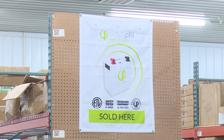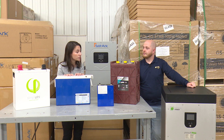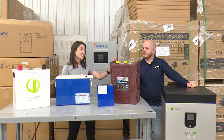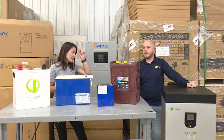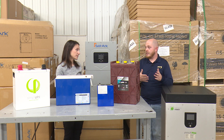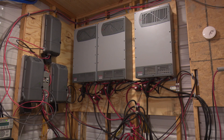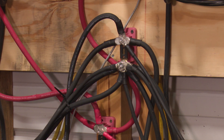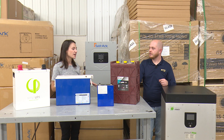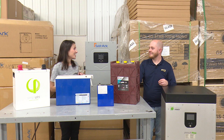If you have the money, the real investment is in lithium technology. At entry level, a lead-acid battery runs several hundred dollars; a sealed AGM runs several thousand; and a lithium battery is ten thousand plus — which seems crazy, but one of these at your house is only about one day of autonomy. To get the same capacity with lead-acid, you'd need 16 or more batteries, and they off-gas, so you'd need exhaust ventilation — not something you'd keep in your kitchen or living room.